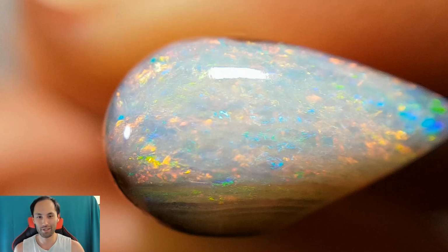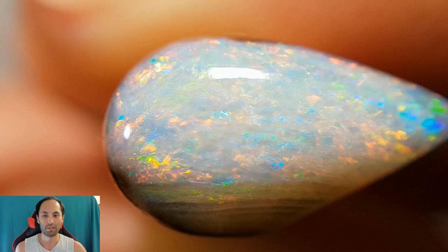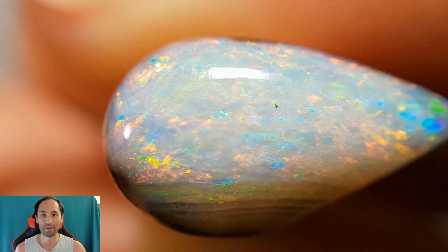Anyway, that'll do for this video. Hopefully it helps someone out there. Like I said, sandpaper, whetstones, Dremels, cutting wheels, flat laps, everything. You need to know when you can move on, otherwise you're burning time. Spend too long on a single grit, you're burning time. Move on too quickly and have to come back to the start, you're burning time. So it's all about just being efficient and just getting the best finish you can by spending the minimum amount of time.